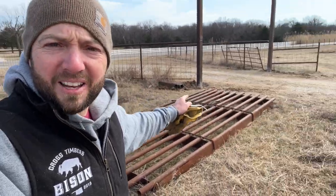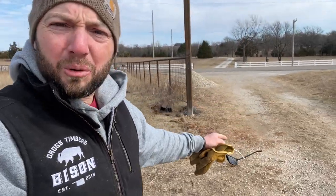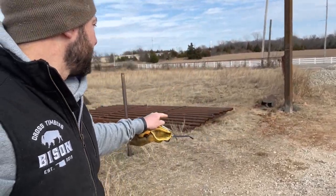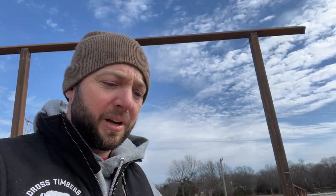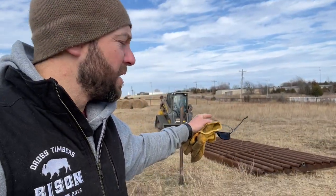What I'm gonna do right now is use the bucket and take off about 2 inches of our surface. We're gonna set this cattle guard down in here. It's about 6.5 inches tall from the very center. We built this overhead at like 14.6, because I think 13.6 is the standard height for tractors or trucks. And so we added 6 inches also for this cattle guard.